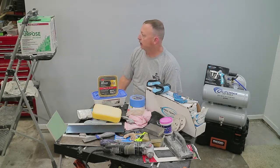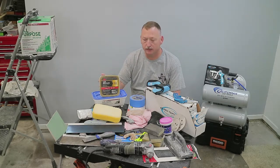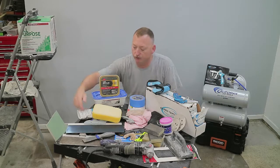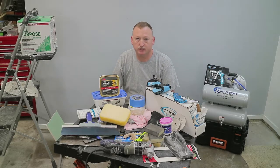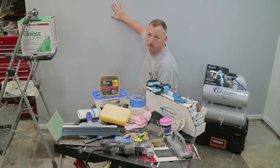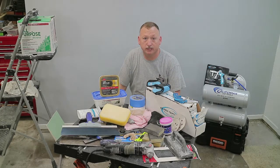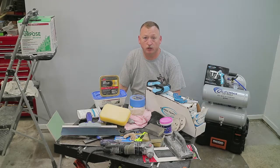I got that hole patched up. Then I used my all-purpose joint compound over the hole, and I also used the 3M wall repair compound on all the little nail holes. I removed any wall anchors and filled those in too. Then I came back with my 14-inch drywall knife and all-purpose joint compound and just started skim coating - about three skim coats, smoothed out after each one. The final product was nice, clean, flat, smooth drywall, ready to accept new texture, whether knock-down, orange peel, or whatever you choose.